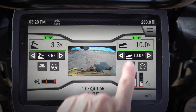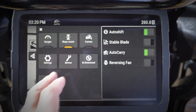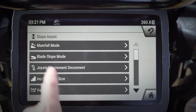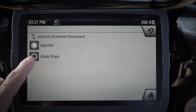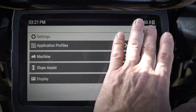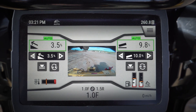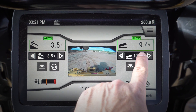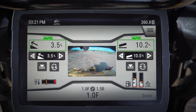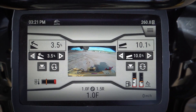But what if I wanted to adjust the other dimension — blade slope? I can go into the settings for slope assist, called joystick increment/decrement, and set which one of those dimensions I want to adjust while using slope assist. So now when I put it into automatics, you'll notice that I'm adjusting my blade slope instead of my main fall. That's how you set the advanced mode increment/decrement with slope assist.